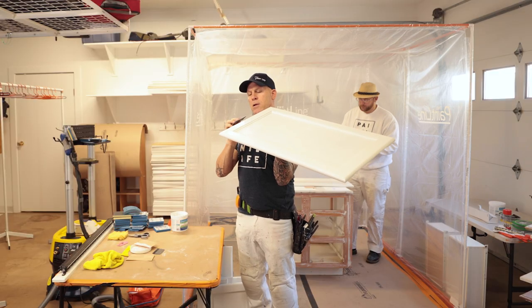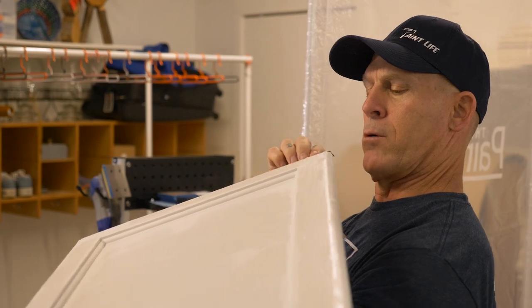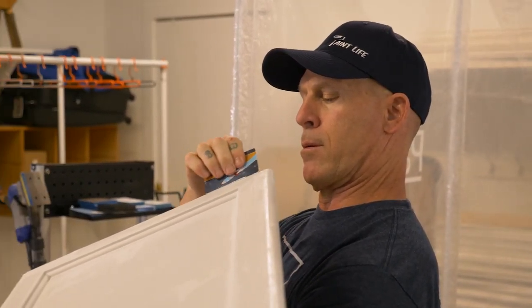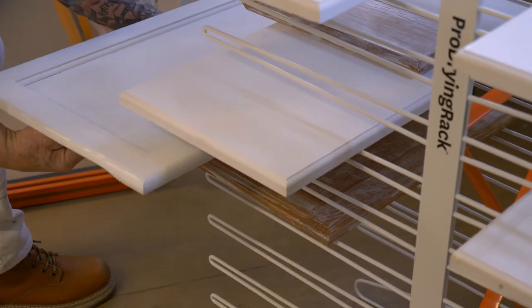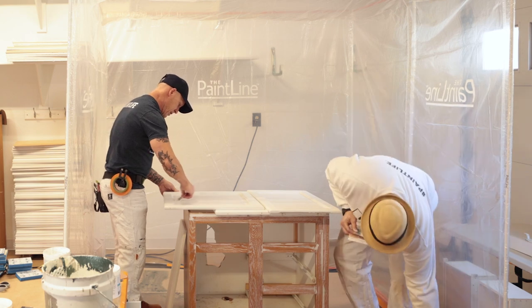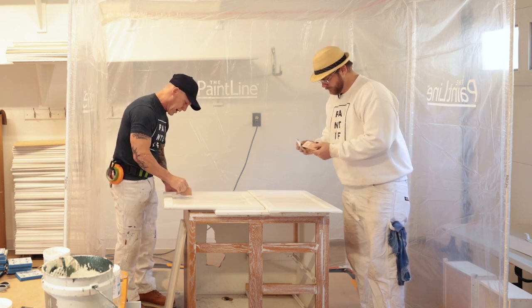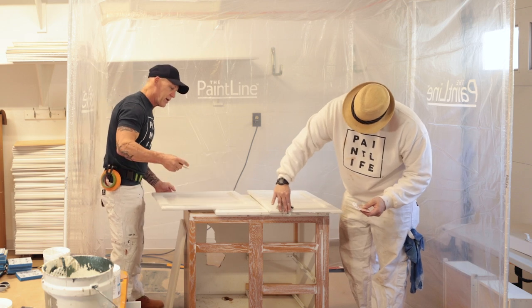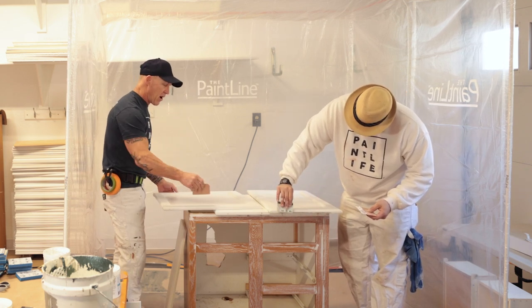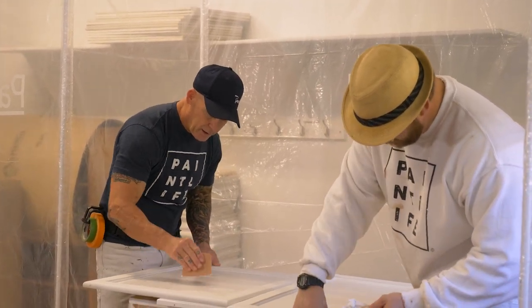The end grain is where the grain is really heavy, really deep. All right, so the front side of this one is done — we'll be doing the back side. I'm going to set this one on a rack. We're just cruising right along working on these panels. This job is a little bit different: we've got these previously coated cabinets where the floating panels are actually going to be caulked. The customer was adamant that they get caulked, so we're still going to try to keep the aqua coat out of the cracks.